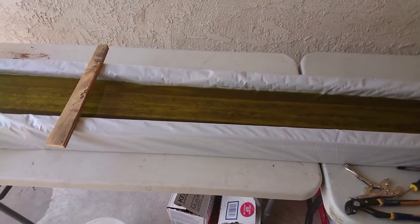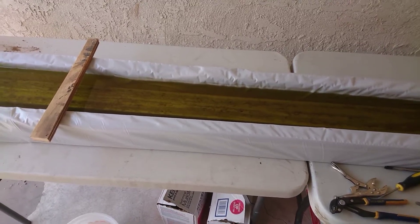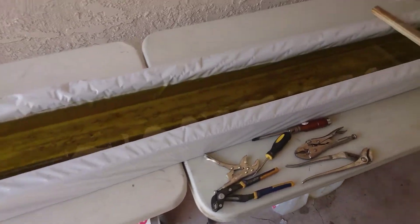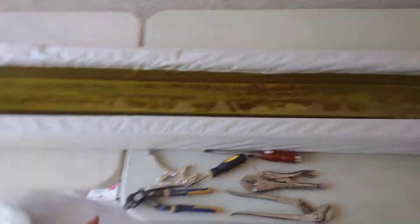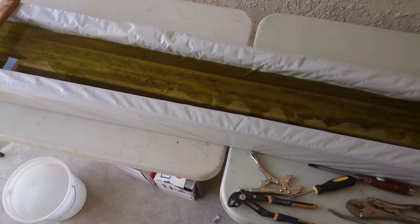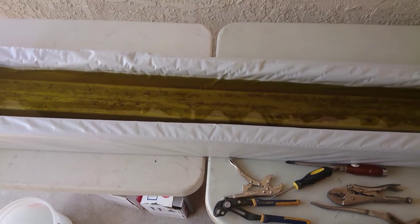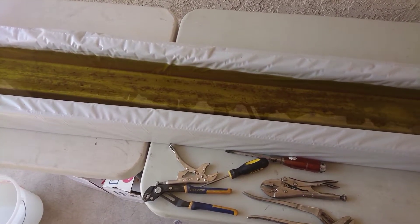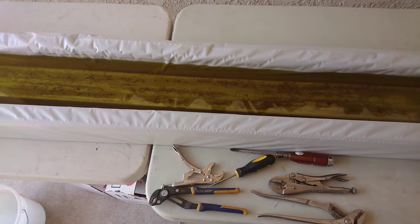What I'm going to do is wash the steel down after the acid bath. It's really important that you neutralize the acid off the steel — just sponge it down with the baking soda and water to neutralize it. It'll help prevent the rust from redeveloping. Everybody knows that muriatic acid causes things to rust again, and that's because you've got to neutralize it.